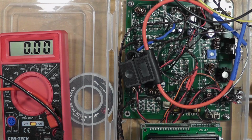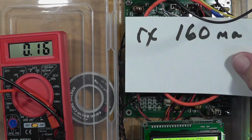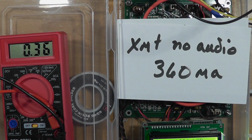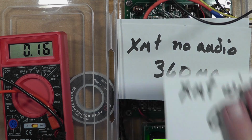So, let's look at some tests. Let's power it up with an ammeter in line and measure the input power on receive. Then we connect a dummy antenna, press the push to talk, and record the milliamps. I did the say hello method, but the max current was way less than the 1 amp the manual says